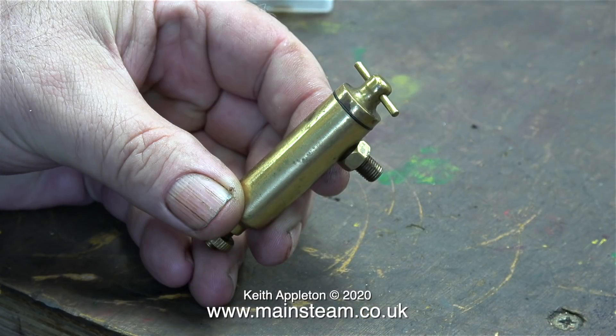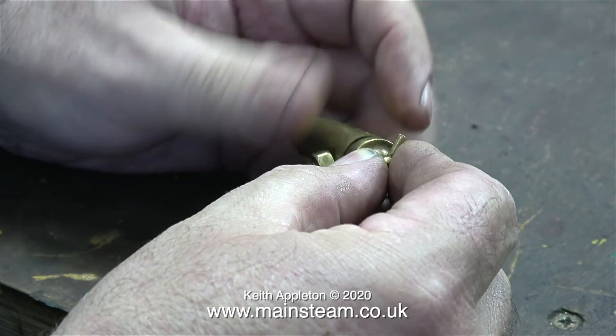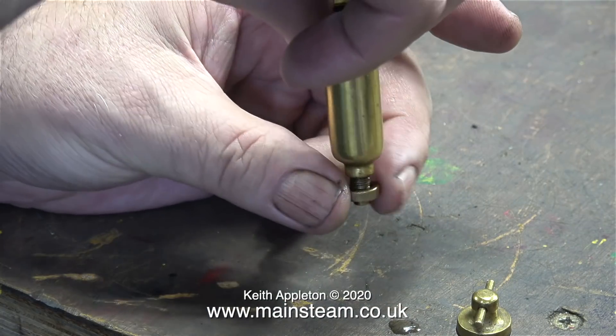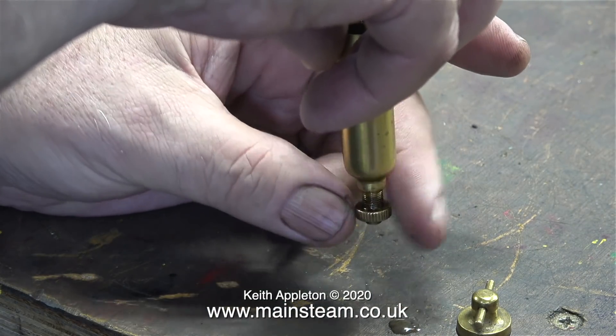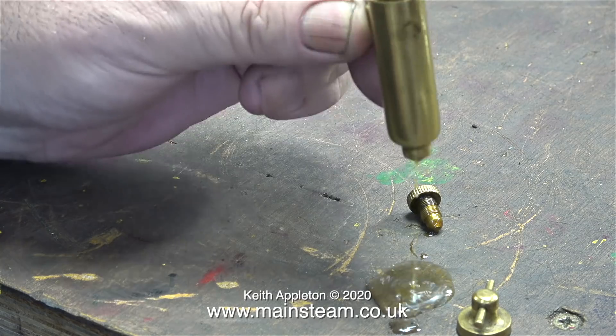So what is this displacement business all about? The water displaces the oil. Here's a type of lubricator that I used to sell a few years ago, made for me by Don English. This type of displacement lubricator is also known as an automatic oiler, mainly because there's no adjustment as to how much oil goes into the steam pipe or the engine. All there is on the end of the pipe that goes into the lubricator — the threaded one — is a very small hole just inside the lubricator. When I take the lid off, you can see there's water in there, and that's why there's a drain tap at the bottom of every displacement lubricator, apart from the very small ones on very small steam engines that use a syringe to empty the water out.